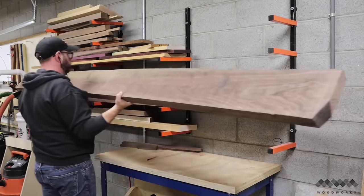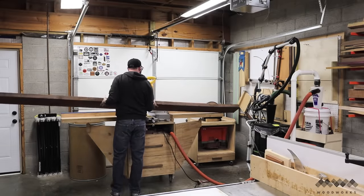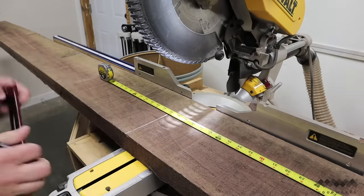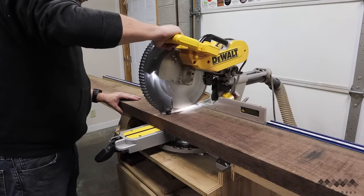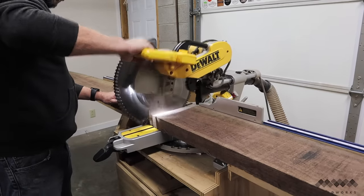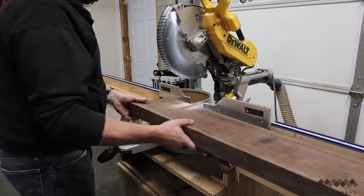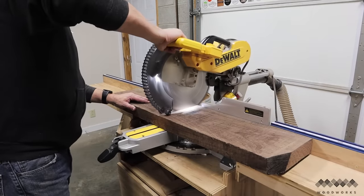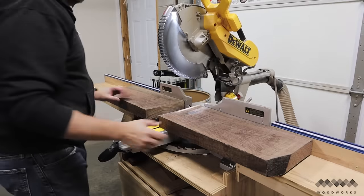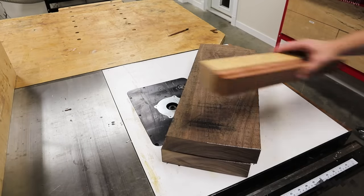The main body of this cutting board will be made of walnut. I have a nice wide eight quarter walnut board that I'll be using. I like using a white marker to strike a line on walnut as it's very easy to see where I need to cut. I'm careful how I cut this rough lumber because any gaps between the lumber and the fence can cause pinching of the blade that can result in kickback. My preferred method is to make multiple passes, completing the cut on the inside first, then finishing with the outside cut.